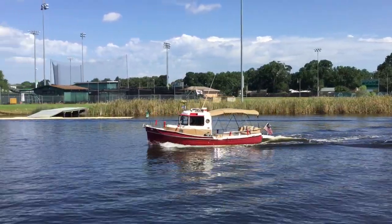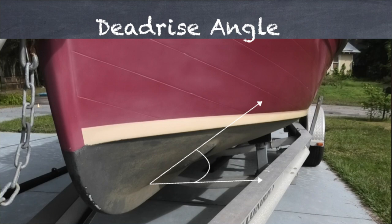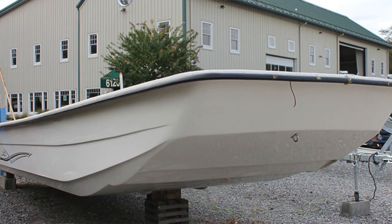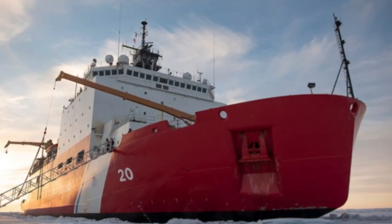Some viewers have wondered what is going on below the waterline, so this is the perfect opportunity to show that. Starting at the bow, we should talk about deadrise, which simply stated is the sharpness of the hull compared to the horizontal plane of the water. A jon boat, skiff, deck boat, or even an icebreaker has a very low, flat deadrise.